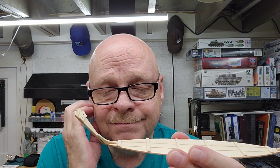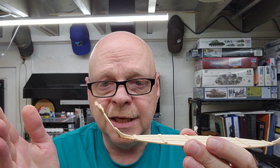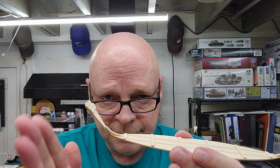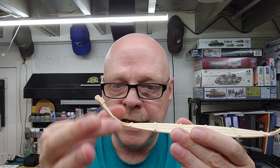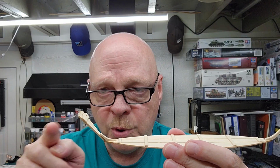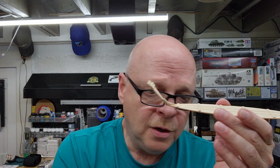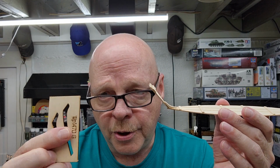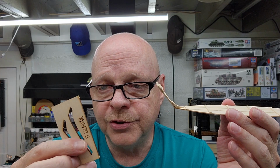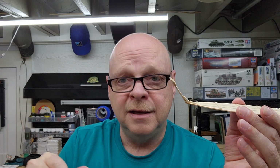And then for our knee, that was a lot of sanding. I mean, it sands quickly. That's not the issue. The issue is trying to get that 90 degree right there. It's got to be this way 90 and that way 90 to the vertical in order for these parts to actually mate up. Because of the laser cutting process, when they burn through it from the front, more wood gets burnt than when the laser exits the backside. So it kind of leaves a bevel there that you've got to straighten up.